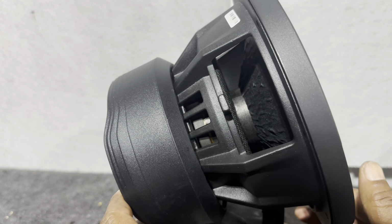This is the rubber boot on the motor. It has a dual slug motor. Venting on the voice coil, pole venting, no holes, chamfered at the top of the pole that I can feel.